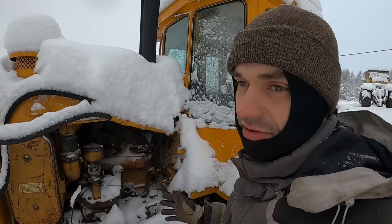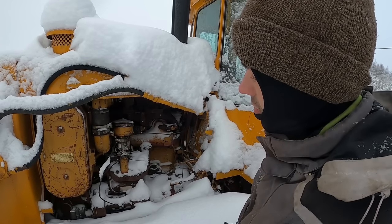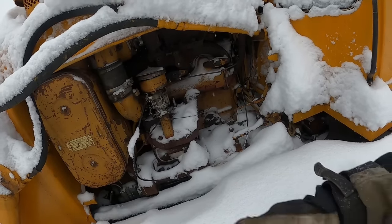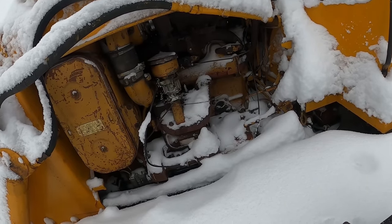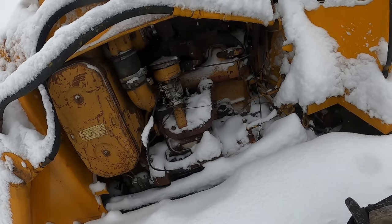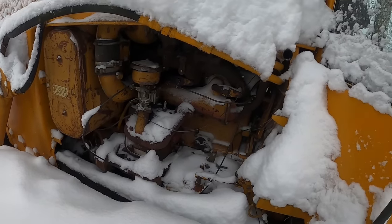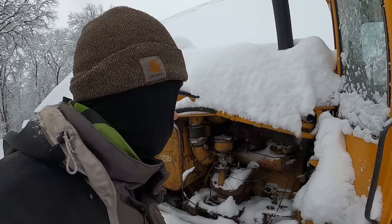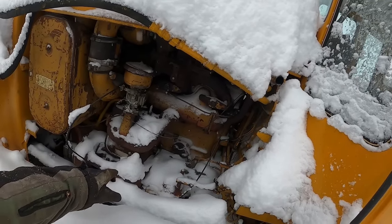And ever since that, it does work, it does fire up, but it's making these weird sounds. I don't know if I broke something by firing it only on one cylinder. Technically, nothing should damage the motor if you have the spark plug out and it's just going at it onesies. But ever since that, the thing has this weird, I guess it's like a misfire type of sound. Maybe you guys will notice it once I fire it up. So I need to fix that issue as well.